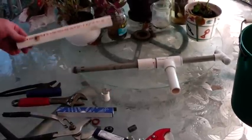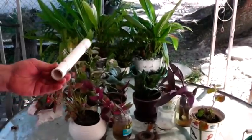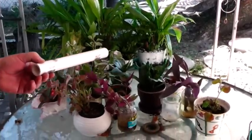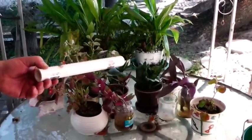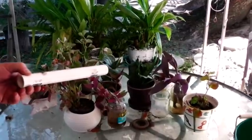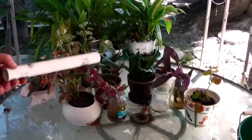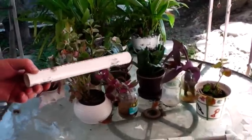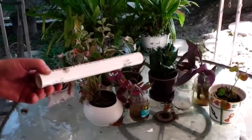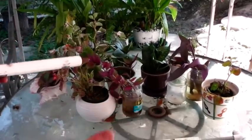This is just some common stuff we had laying around — some one-inch PVC. If you saw the covert well video, you know this prepper has a half-horsepower electric motor running it, a generator as backup, and a hand pump. His current water level is about 15 feet right now. Pitcher pumps are only effective down to 20 or 30 feet, so if the water table were to drop, he's going to need some other way to get water out, and this is how you do it.